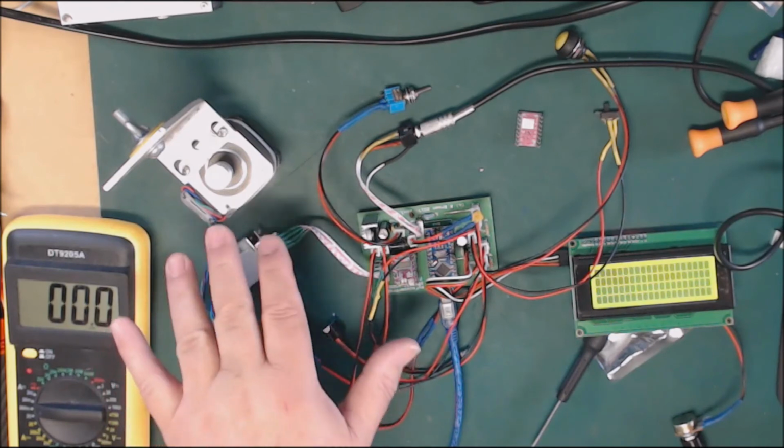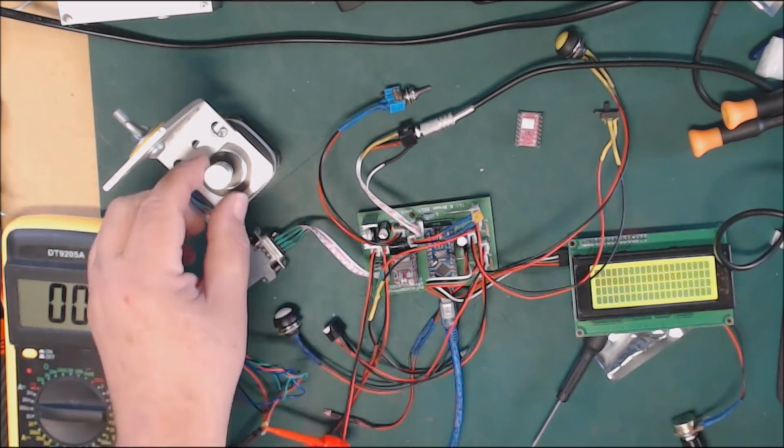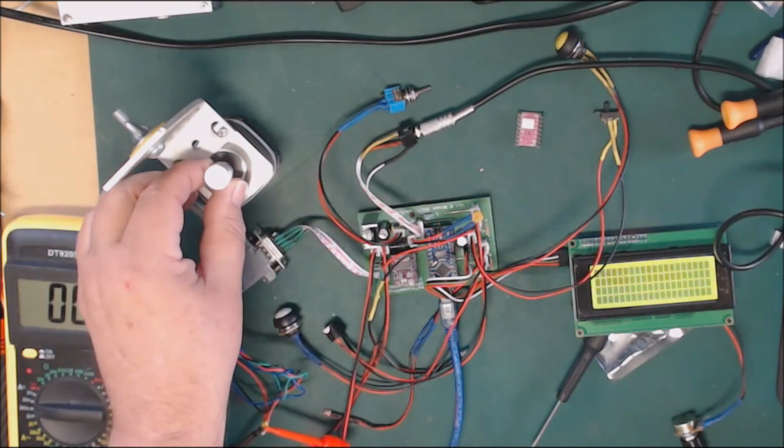Now you heard a slight pause every now and again, and that's because of the settings. In the extra settings, let me just disconnect the controller. In extra settings I've got the update position when moving option on, and if I turn that off and then reconnect to the controller, and tell it to go a long way, I don't get those little interruptions every now and again. It just goes straight to 9,000. So if you do have that update position when moving on in extra settings, then every so often it's got to grab the position from the controller, which interrupts the stepping just fractionally.